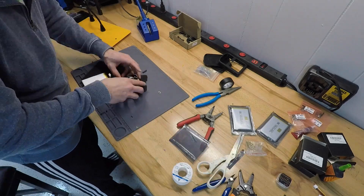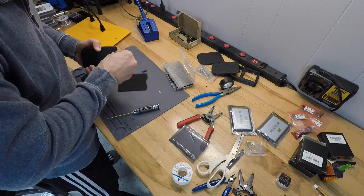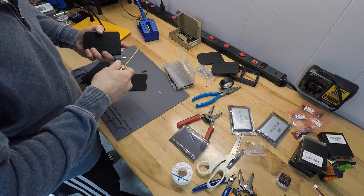Check the polarity of your battery with the T-deck connection. Carefully insert the T-deck — it will be a tight fit and it's easy to damage it, so be careful. If you arrange the components just right, they will just fit. If they don't, rearrange your components.